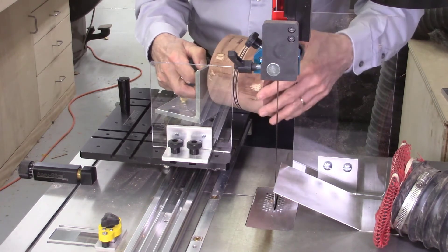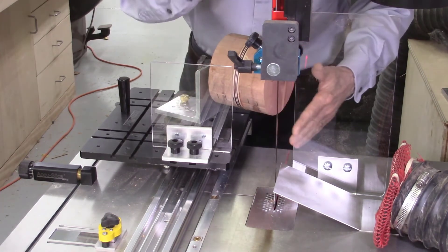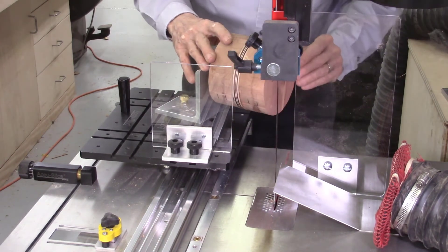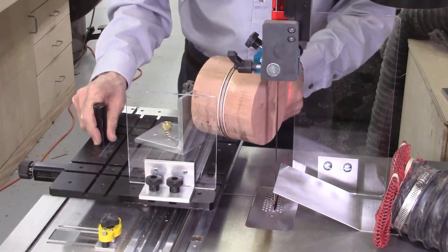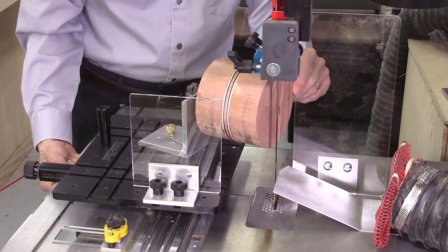I'm using these index positions, putting them at 90 degrees so I can use my laser beam. I turn on the AccuPath laser, which rides perfectly down the teeth of the blade and projects the beam out. I position my cut so the laser beam goes right down and aligns right at the edge of the first mark on the board.